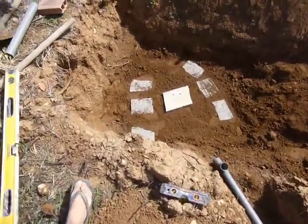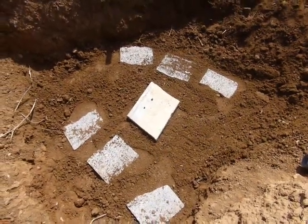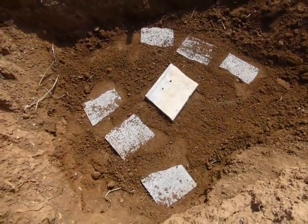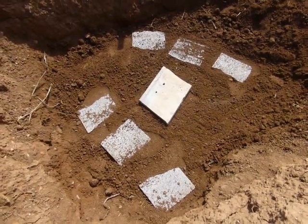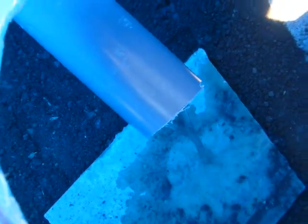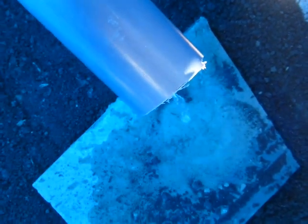In the bottom of the pit we've leveled off the ground. You've got the bits of brick on the outside for the barrel to sit on, so that when the earth is soft it doesn't sink in. The tile in the middle is so that when the water comes out the pipe, it hits the tile and then disperses, so you don't get a buildup of solids there — they come off.